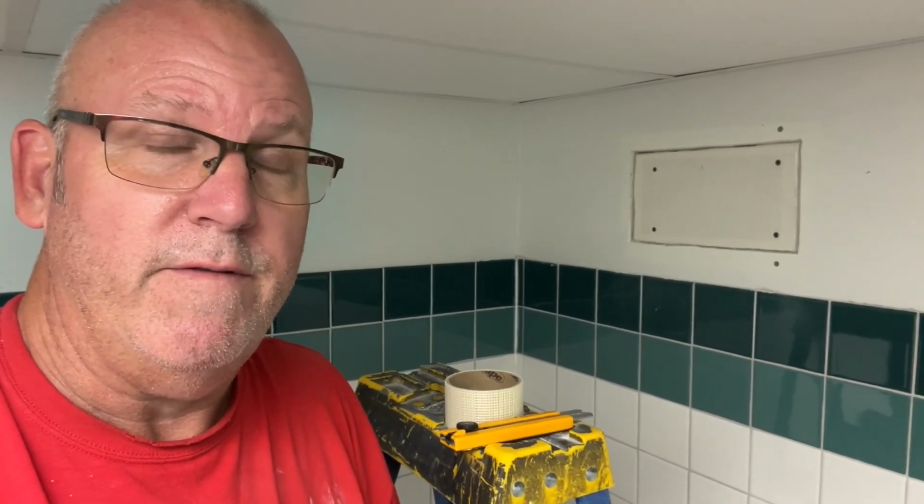So now the last thing I need to do is just put mud in the crack, really. It should only take 2 applications if I'm lucky. The first one, really the goal is just to pack mud in between the patch piece and the wall. And then when that dries, I should be able to just do a nice thin skim coat over the top of that and finish up any last imperfections. So let's go for that first mud pack coat.